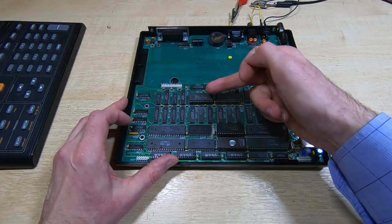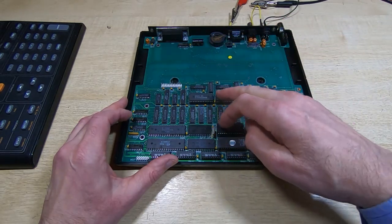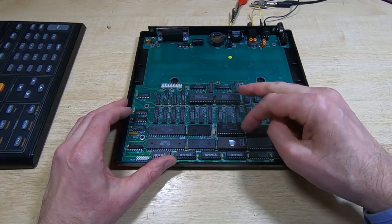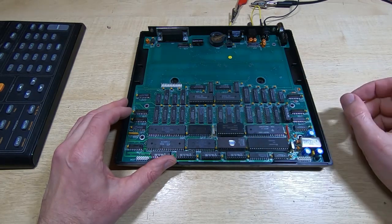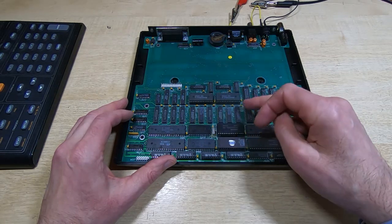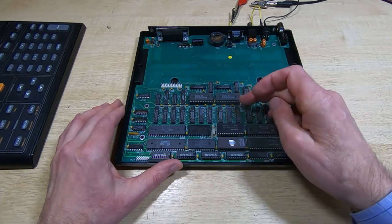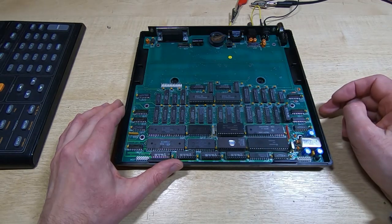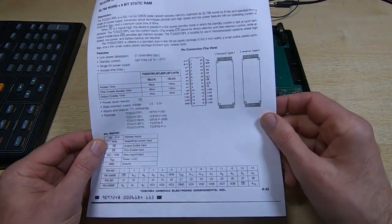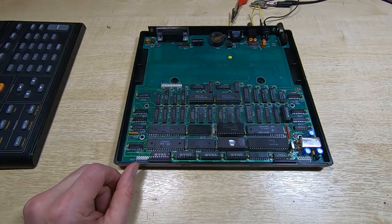Looking at the nature of the fault, I didn't think it was the PALs. We have the three RAM chips - these two are connected as a pair and then this standalone one. They're all really equivalent types but this one was a different type and manufacturer to these two, and they were all soldered to the board with no sign of previous replacement, so I suspect it was original. When I fitted the replacements - these are all new chips - although they're not the same type that was fitted, they are pin equivalents, and I did maintain the timing relationship to the same speed SRAMs that were fitted originally.